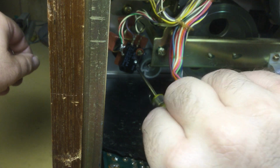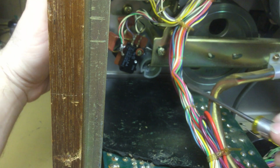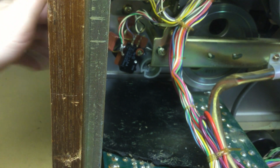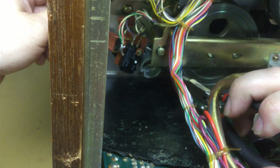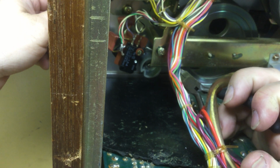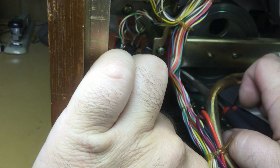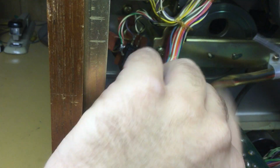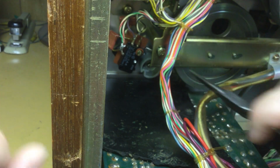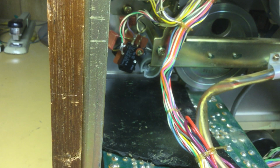and then get the spring and see it fell back down. But the name of the game is getting the end of that hook on the spring and putting it back in that cutout on the cam. So I'm going to remove this plate. I'll come back.